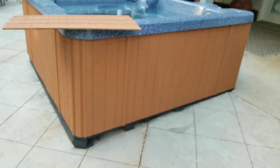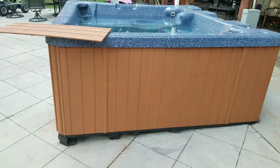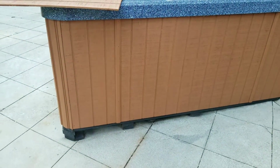And I'll tell you one more thing. You could do this a whole lot easier. If I had bought, now I only did 3 sides, as you know, but if I had just taken 3 sheets of plywood and just ripped them at 31.5 inches, which is what that is, and just made the whole thing one sheet right down through here, no seams, just turned it the other way, in other words. So I mean, you see what I'm saying? Just turn the sheet where your lines would have been horizontal, and you wouldn't have any seams. You would just run it from here to here and pick up on these studs in the middle to anchor it to, and that would have been really easy.